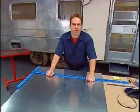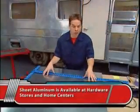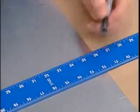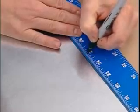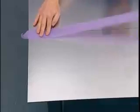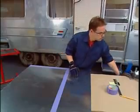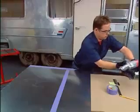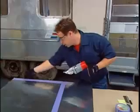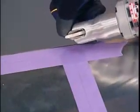We're going to start by covering our countertop with sheet aluminum. The aluminum sheeting we're using is a 36 by 36 piece — this costs about $20. I measure out the dimensions of the countertop, plus 11 sixteenths of an inch for the lip of the counter. I also lay down tape over the cut lines to protect the surface of the aluminum. As always, when working with metal, which can be sharp, wear heavy-duty gloves and eye protection. We're using an electric shear because it makes a beautiful straight cut, and all we're doing is following our guide. The width of our shear takes out about an eighth of an inch, so we're aligning the inside edge of our shear up with our cut line.